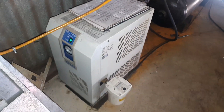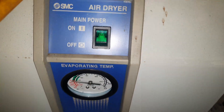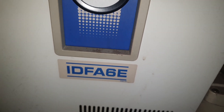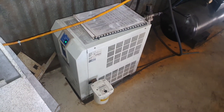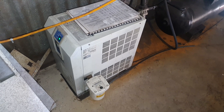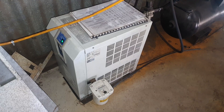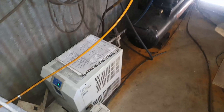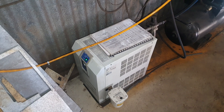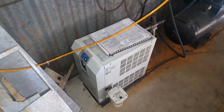It doesn't run continuously, which is important, and gives a fair amount of air. It's the largest compressor you can get being triple head on a single phase 15-amp supply. That runs to a refrigerated chiller — it's a SMC IDF A6E air dryer. Again, been reliable, been there about three years. It was something like $2,000 at the time, which included the micron filters, which I've never had to change because I run it through multiple water traps and filters before it gets to the chiller. In the past I tried a copper pipe system up the shed wall but in this very humid climate it just wasn't working, and if you get water in your air supply to the plasma it'll blow the tips out.